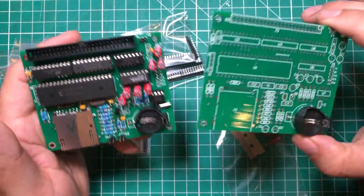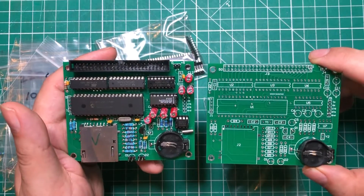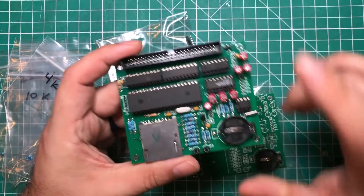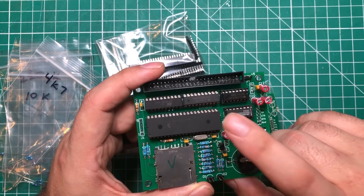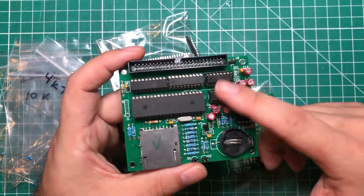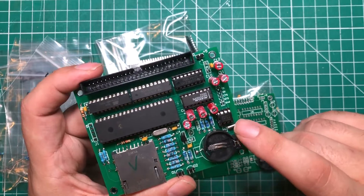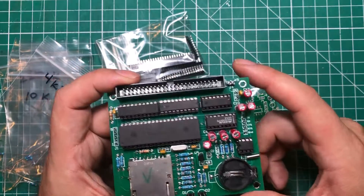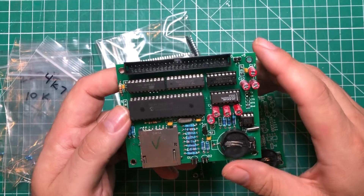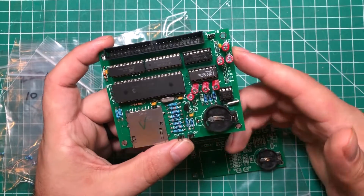With these PCBs, instead of watching me solder, I wanted to go over a couple things you need to know. If you're interested in making your own, you can go to pcbway.com and get the boards. Eleven of them might run you 20 or 30 bucks, and the parts are relatively cheap. The most expensive part is the PIC controller, which cost me about five bucks or a little less in bulk. You actually don't need a lot of the things on the board. If you're not interested in the real-time clock, you can get rid of it along with some of the passives. If you program it with an EEPROM programmer, you can also get rid of some of the RS-232 stuff. This board can really be stripped down to where it costs next to nothing to make — and that's what makes PCBWay so awesome.